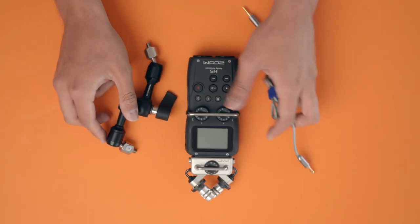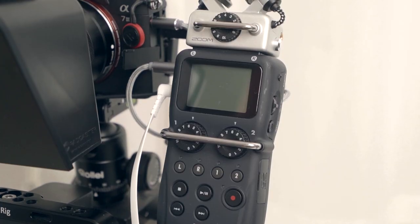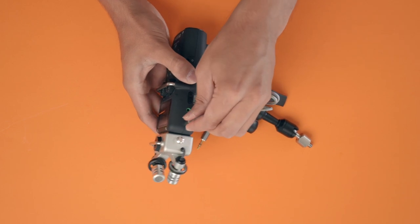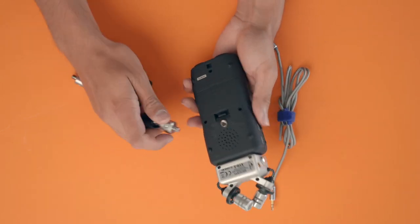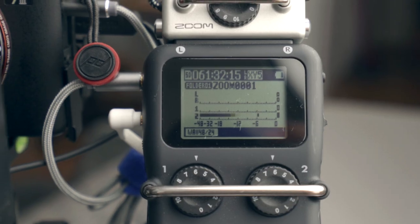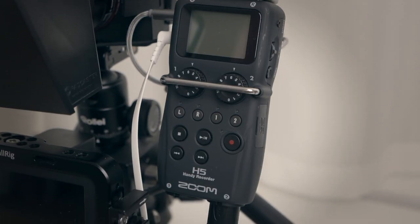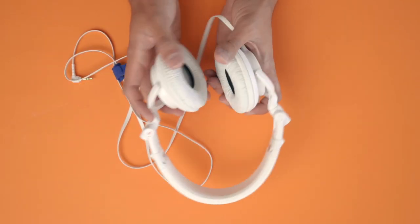To monitor the audio I use the Zoom H5, which is connected to the NTG4 Plus using an XLR cable and to the Sony A7 III using a 3.5mm audio cable. To hold the Zoom H5 in place I use a small magic arm screwed to the mega clamp. With the levels displayed on the screen I can make sure that the audio isn't peaking, staying between minus 6 and minus 12 decibels. I always do an audio test before I start recording. I use Sony headphones to monitor my voice and I usually leave them on while filming because when I get excited sometimes there are unwanted pop noises — and I don't want that on my audio.